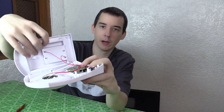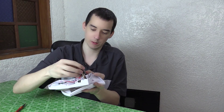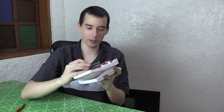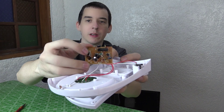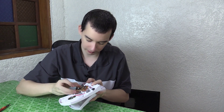Inside, you'll see we have wires going to the battery pack on the back, a DC jack here, and at the top an LDR which detects whether the sun is still up. Then we have the main board. In here we have the LED board, which goes to the LEDs — nothing else in there, just the LEDs. So the main board is what we're interested in. You can see there's at least one resistor that's just floating in the air, not doing anything. On the board you can see the switch, the PIR sensor itself, some capacitors, and a couple of resistors.